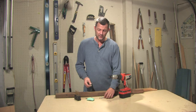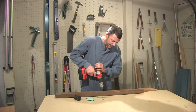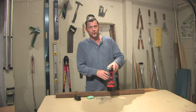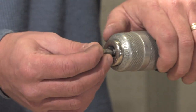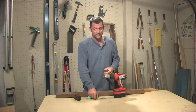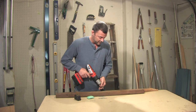There are a couple of methods you can use to get that screw to go in a little bit easier. One, you can drill a pilot hole, which allows a little more room for your screw to go into the wood so you don't strip it out or break off the head. But it does take a little extra time than our second method, because you have to change out the drill bit with the Phillips head, and so on.